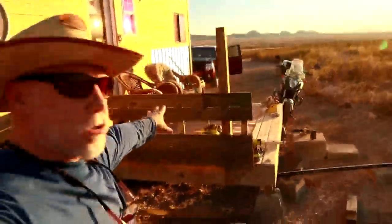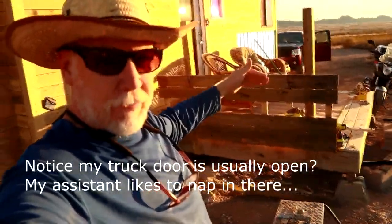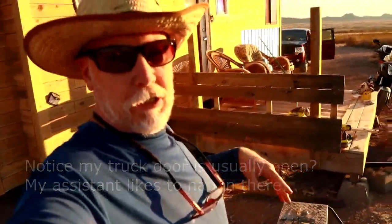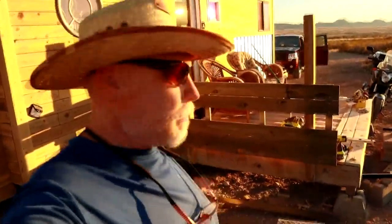So I'm taking the screws out and I'm lowering them all about half a centimeter over the course of five courses. That'll actually lower the top board by, you know, 3/4 of an inch or so, an inch. And hopefully it'll close most of those gaps. Then I'm gonna put my second panel up above it, do the same thing. Then I'm gonna sand the whole thing, reinforce it a little, stain it, etc. But you get the idea. So I'm just gonna keep going. I'll show you what it looks like after I get the second panel on.